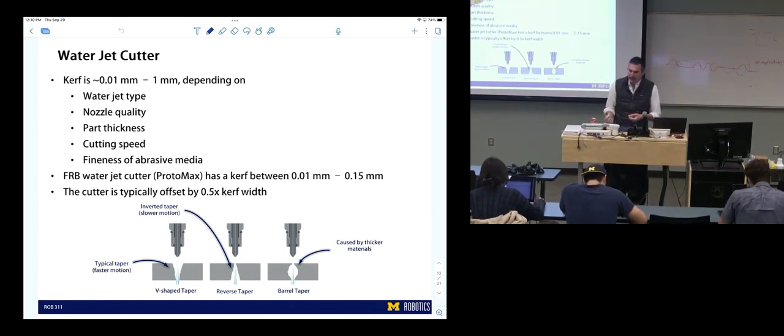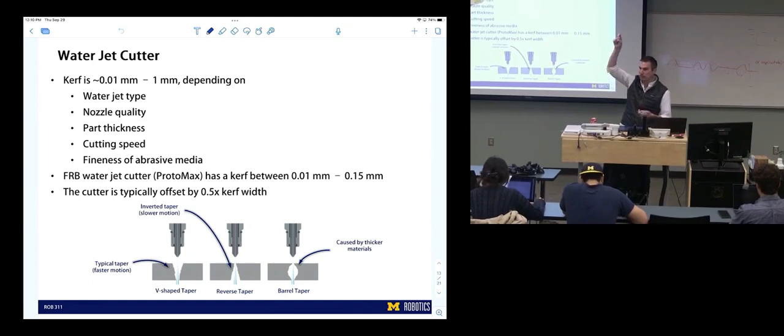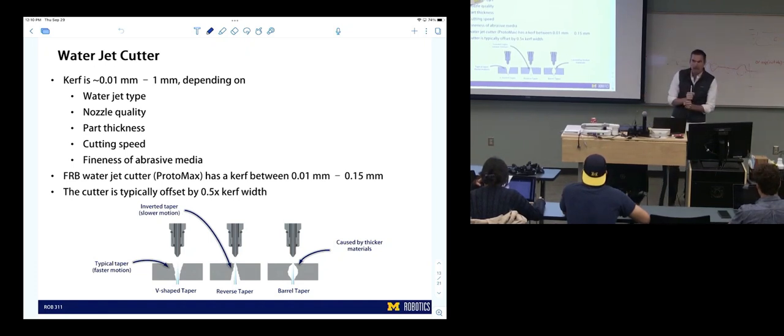I would probably think of it as, it's like you have a resistor. That nozzle is a resistor. It's going to pull pressure off of that stream. So it's flowing fluid through a resistance. This is just like current flowing through a resistor. So we're going to lose pressure, like a voltage drop. The more loss there is in that nozzle, the rougher it is, the smaller the diameter, the more pressure we're going to lose through that. The more pressure we lose, the more cutting power we lose.